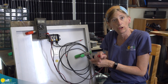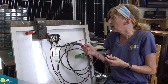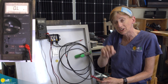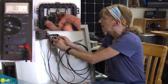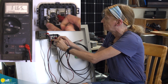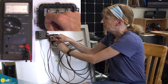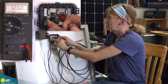If you measure an overload in both directions, that tells you the diode is open and therefore broken. If you measure a low voltage in both directions, that tells you it's actually shorted. Another way to test is if your multimeter doesn't have a diode setting — you can use the ohm setting. One direction I'm reading about 12 mega ohms; the other direction it's open. So it's an open connection one direction and 12 mega ohms resistance the other direction.